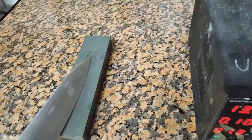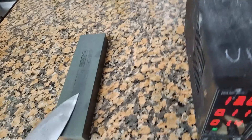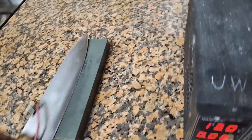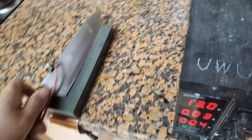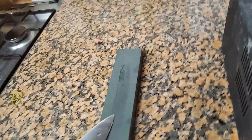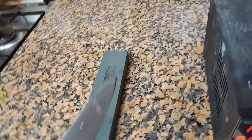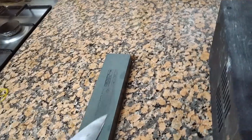The most important reason for this is because whenever you sharpen something, the biggest thing that prevents an edge from being built is a burr. When you have a burr at the end of an edge, it is not very sharp. With just pure abrasive grinding, this burr exists. However, with electrochemical grinding, the burr is dissolved away by the action of the acidic anions that are generated at the anode, which oxidize the metal away.